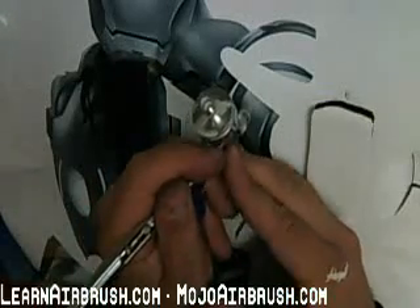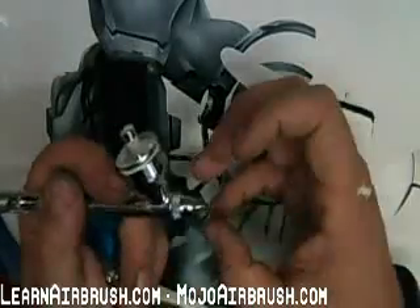With the complexity of the shape of the tips and needles — the taper — I guess I could draw this out a little easier. Do you have a Sharpie? Understanding the mechanics of the airbrush, I'll draw it right here on this mask. Say you've got this taper on the needle, and then you have your fluid tip kind of wrapped around it — the inner edge is like this, the outer edge is like that — so your contact point allows this to seat somewhere back in here.